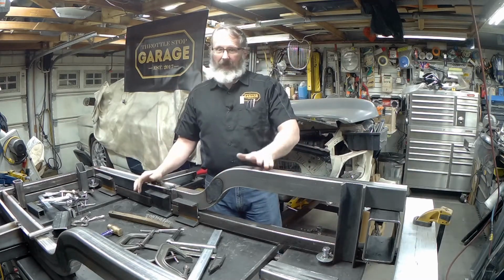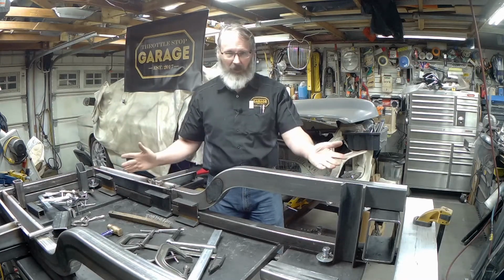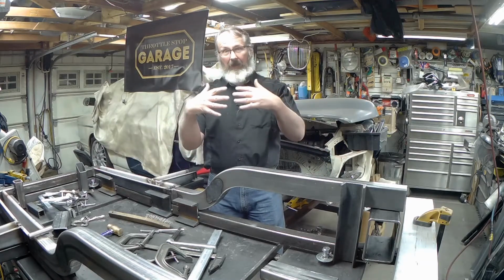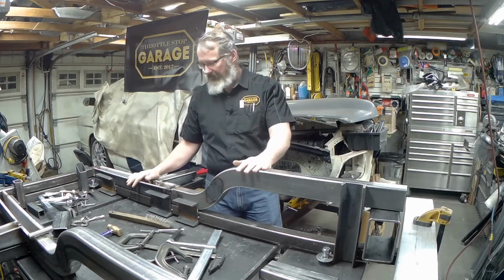So, you know, pull the clamps off, clamp it at the back. Give yourself a pivot point. In that case, I put it right underneath the weld. I know it's pulled. Okay, so it shrunk. I need to stretch it a little bit to get it back to about 0. Now, it's an imprecise science, as I've just checked the rails.